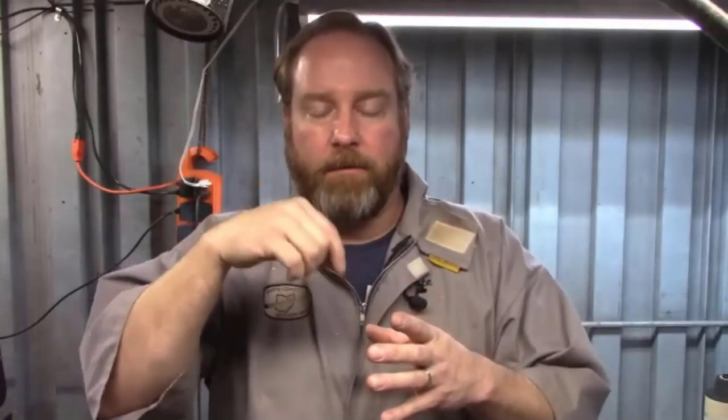In the beginning, you showed some pictures of stave design. Yep. How do you cut the angle for the stave design? I can't imagine you using this wedge. No, that was well before the wedgie sled. What I did was cut it all on a table saw, and I had to do the old geometry math and figure out how many pieces I wanted to make up that whole ring, and then what angle each side of the staves or the wedges needed to be. If I remember correctly, that was quite a few years ago, but it was a fair amount of back and forth between cutting pieces and then verifying that I'd actually created the triangle that I was looking for.